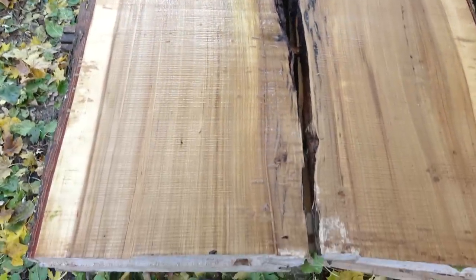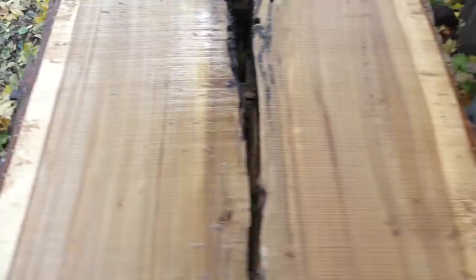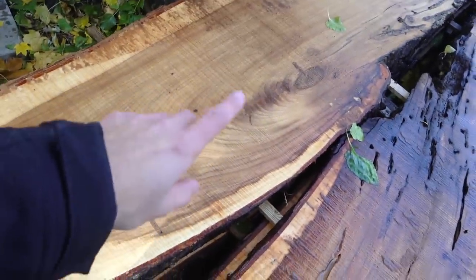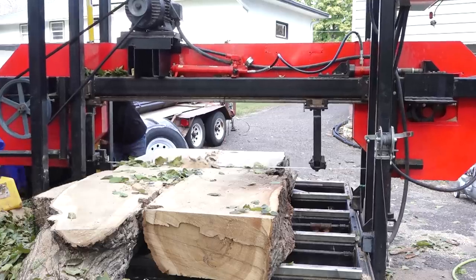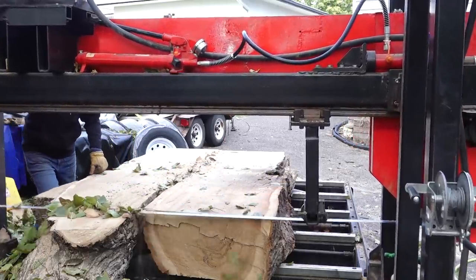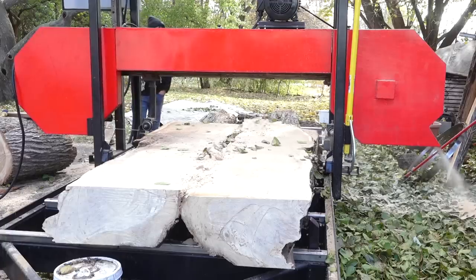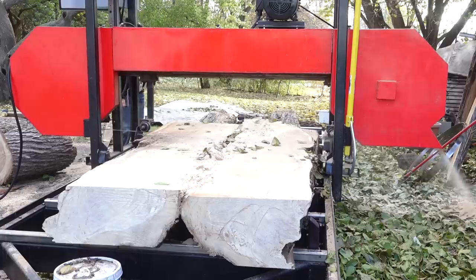Down here, all quarter sawn. Really nice color, really nice straight grain. Here's a look at some of that topside crotch figure. We're gonna have the bullseye type effect with the feather going in this direction as opposed to in that direction. So it looks like we have, what, three more cuts to make to separate what's on the mill into the four remaining slabs, or I guess since these are separate, the eight remaining slabs. So time to get back to sawing for a little while.